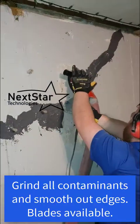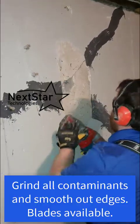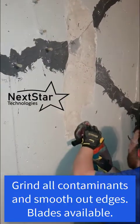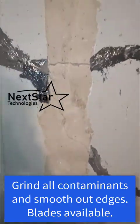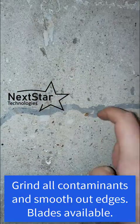This video is a quick summary of how to install carbon fiber strips on a poured basement wall. Here we're surface grinding with a 5-inch diamond grinder blade, using a fancy shroud and vacuum to keep the dust down. We've already completed epoxy injection on this one — you can see all the paste from completing that and completely filling the crack with epoxy.